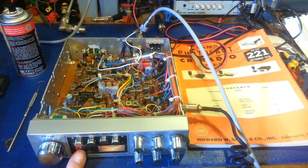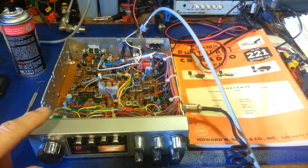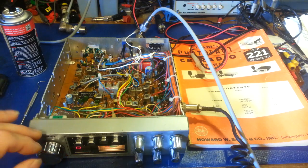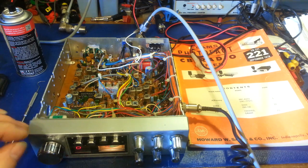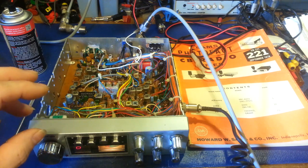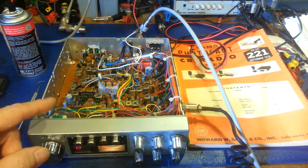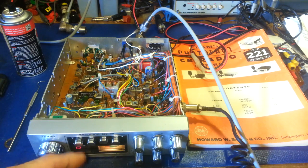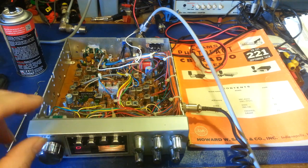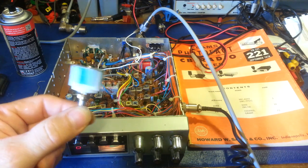If a segment's just out and never comes on, there's a good chance it's a bad display segment. If it's an older radio that had DIP-packaged resistors — dual inline package, looks like an IC chip but they're resistors — some older radios especially from the 70s, those resistors actually start to come apart and fail. But in radios like this, they use axial-leaded resistors as the dropping resistors. So if you see it flickering on and off, getting bright and dim, it's usually not those.